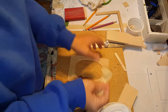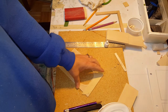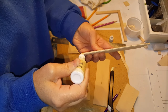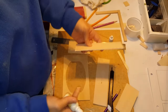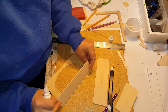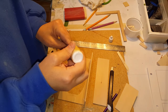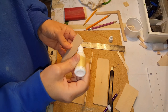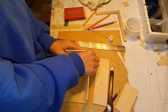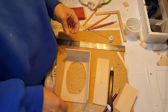Make sure you have them even, and do the same to the other side. Next you want to take your sides and your top and get them ready — pre-sand them. Take your side, apply some glue right along the edge, and then put it directly on top making sure that it's even with this edge. Then take your other side, apply glue on that edge and all along the bottom edge, and then glue them together. Put some masking tape on it to hold it until it dries, then do these two sides the same exact way.